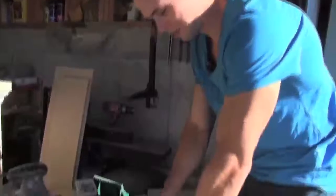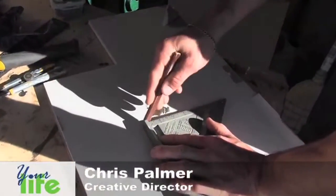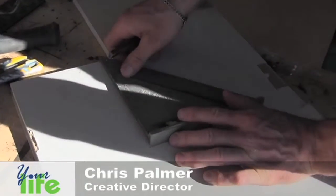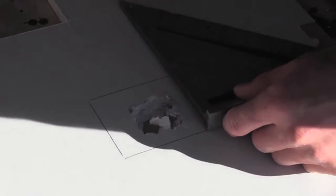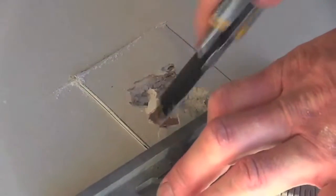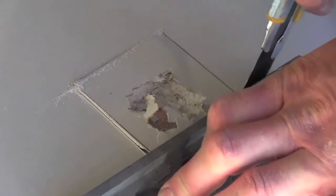So we have a hole in the patch of drywall and you want to fix it. Basically, given the size of the hole, you want to enlarge it so that you can cut a square patch to make life easier for seaming. We offset the measurements, creating a larger area. All we're doing is creating a nice square edge to work with so that we don't have to worry about patching an ugly seam.